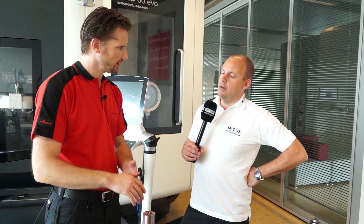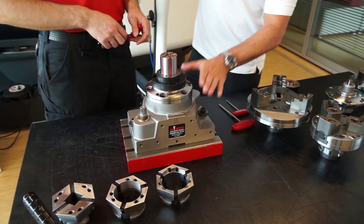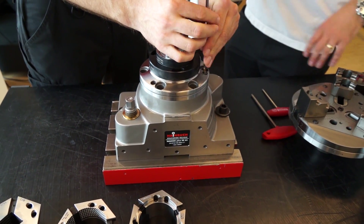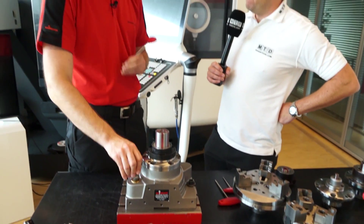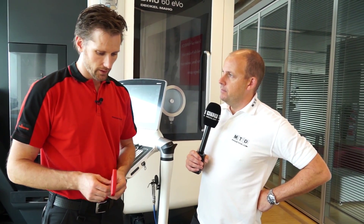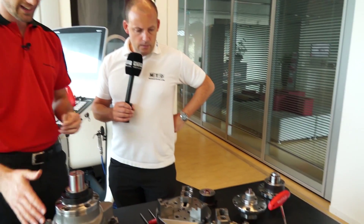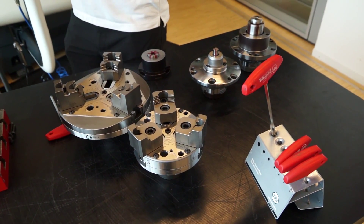It's the same as the Manok but it just has a piston below. The principle is exactly the same. The biggest factor when we talk about flexibility is the fact that although the Manok is for milling, all the adaptations can be used within your turning range as well. By selecting the basic work holding — in this case a manual actuated Manok, which you don't use for series production — when you use a hydraulic one you can use it for series. All clamping heads or adaptations you can use on any basic work holding; doesn't matter if grinding, turning, or milling.